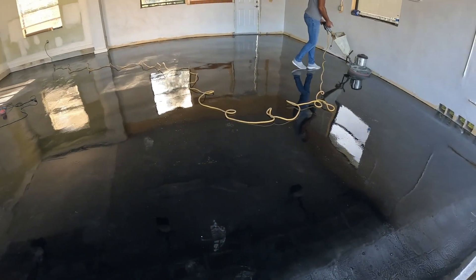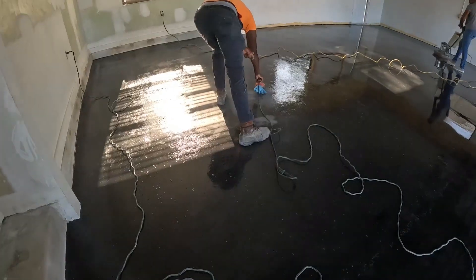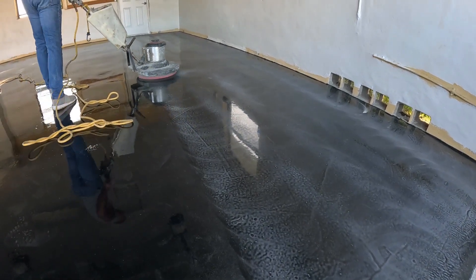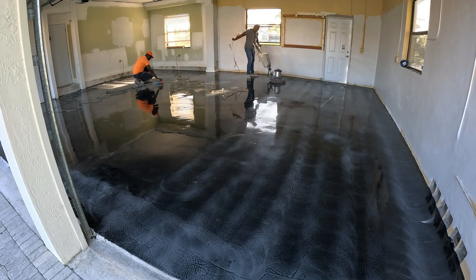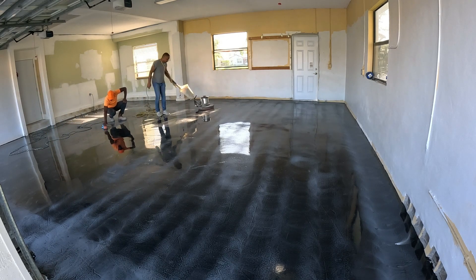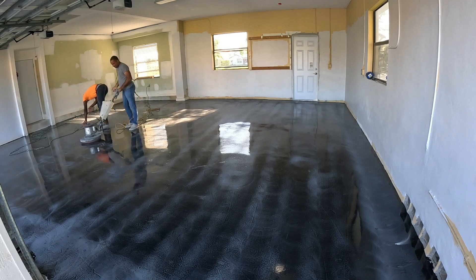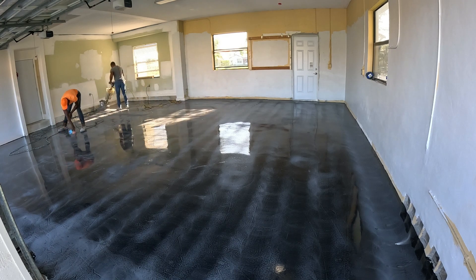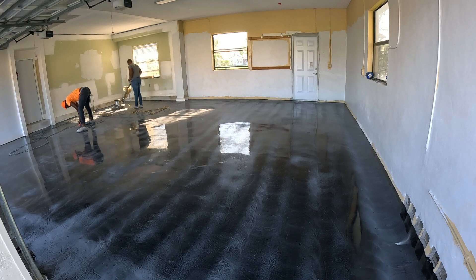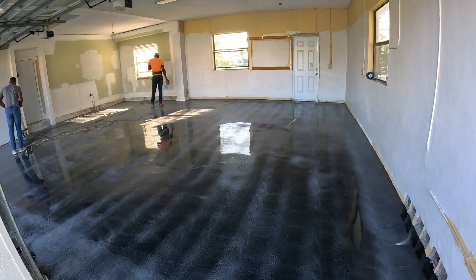After the primer, a machine buffer — like something you'd see waxing floors — was used with an 80-grit to scuff the surface and knock anything down. Over on the new slab, a sander knocked down the ridges from the bubbles. On the rest of the surface, they moved in an organized back-and-forth fashion to knock the top off any high areas. Keep in mind, no slab will ever be perfectly flat — we're just removing defects that would really catch your eye once the epoxy hits.